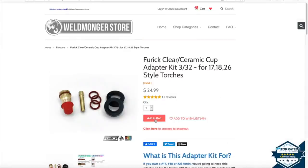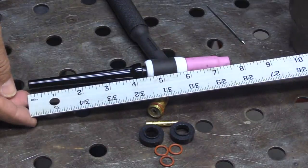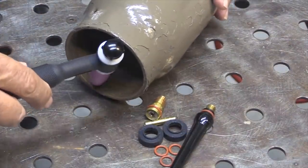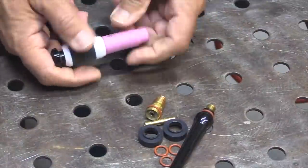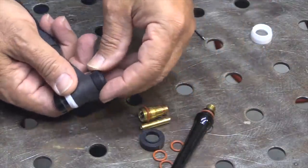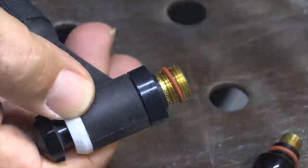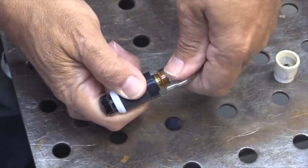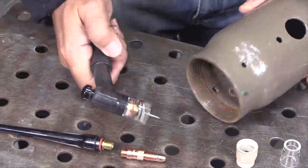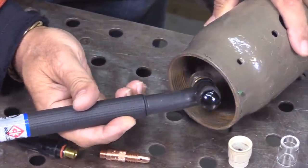There's nothing really wrong with the standard hardware that comes with these torches — the long tail is a bit long for real work. Even when you shorten it up you can only go so far. But to get better gas shielding and shorten up the overall torch length, this adapter kit will do it. You swap out the white insulator with the new one, install the collet and collet body gas lens with the o-ring — moisten the o-ring — and slip on a clear cup like the Jazzy 10, which is great for stainless steel, nickel alloys, titanium, and chromoly. It shortens the torch and gives you really good gas coverage and lets you use a long stick-out when needed.